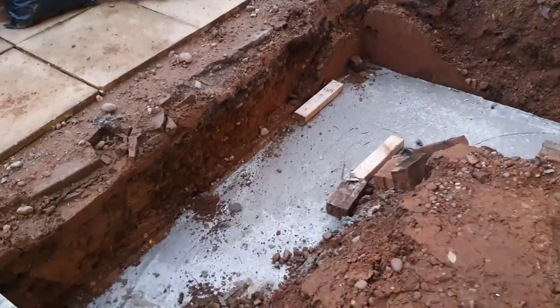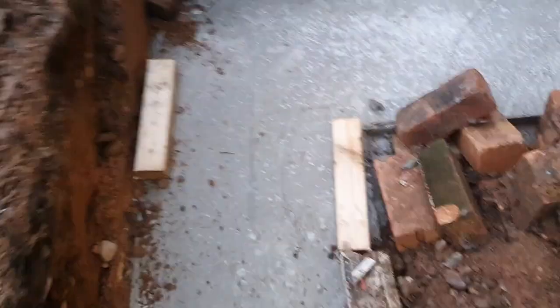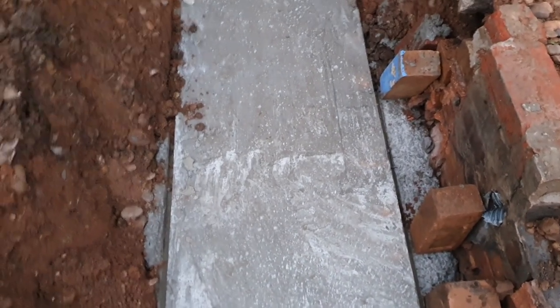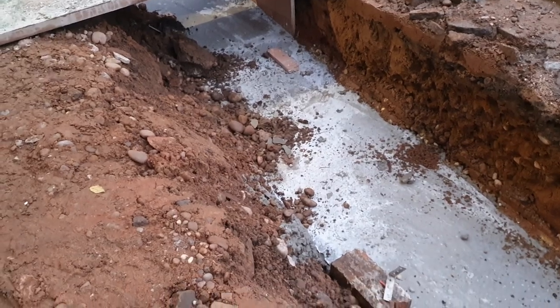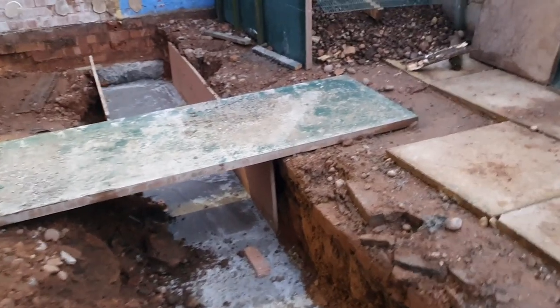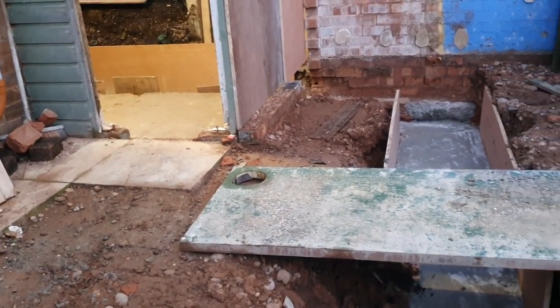It's all gone nice and solid — I can walk on it. I just fell down this bit here, which is why it's all caved in. But what we'll do is get this slanted off either side, sweep off the footing, and then we'll be ready to start laying our blockwork — sorry, laying our concrete. Not much else to really talk about until we see some movement; it's just very slow going and lots of work on the computer figuring out how many bricks and blocks I need.